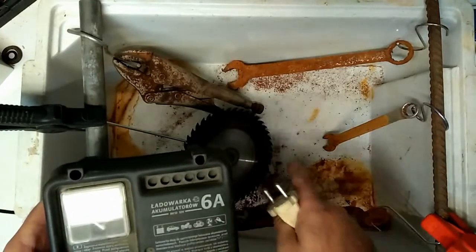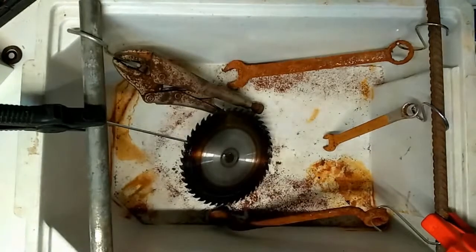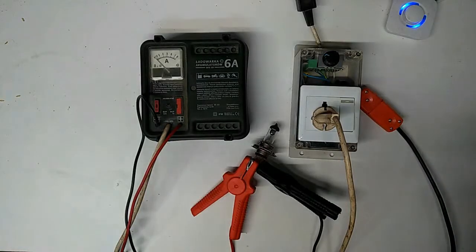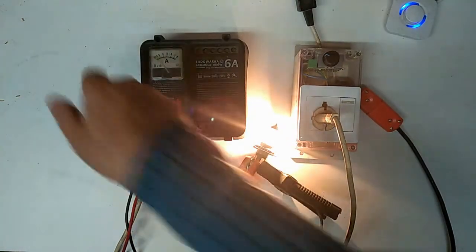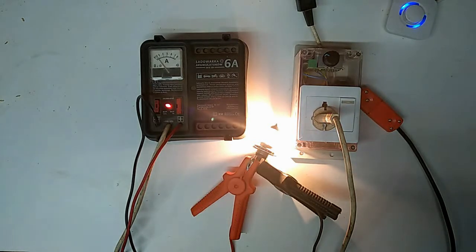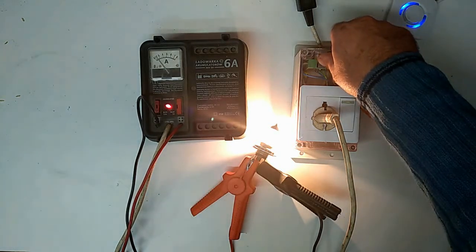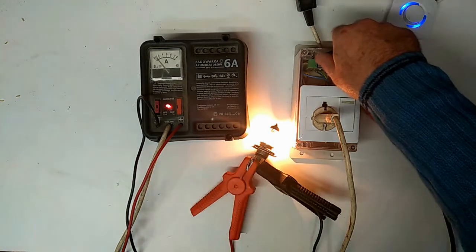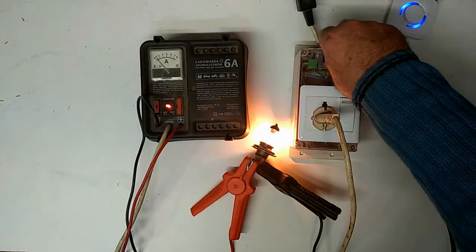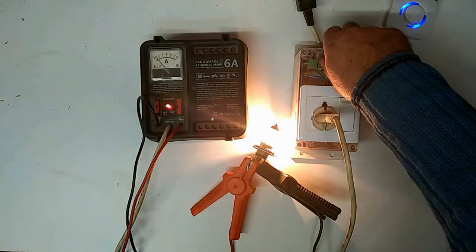Now I'll demonstrate that, not with the electrolysis rust remover, but using some 12-volt car electrics. I've connected up the battery charger to a 12-volt car headlamp bulb. If I turn that on, you see the current it's being drawn. Now, if that was the tank which was passing too much current from the cathode to the anode, by connecting up the controller here, as I reduce it, you can see that the current drops down to a more manageable level. In this case, the headlamp bulb is getting dimmer. I won't keep it on too long because the headlamp bulb gets quite hot and draws a fair bit of current.